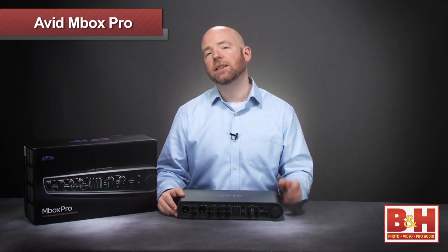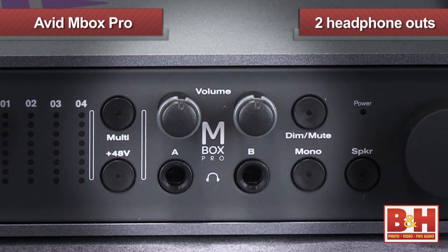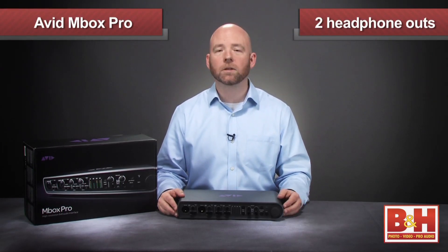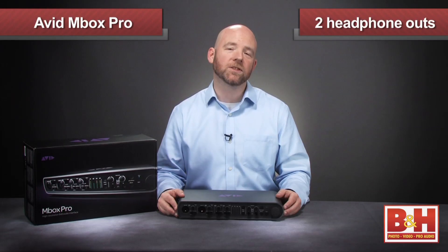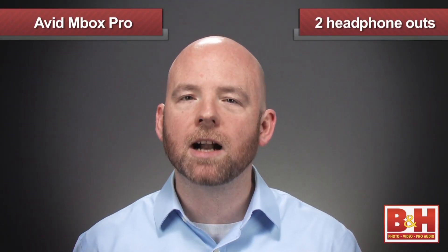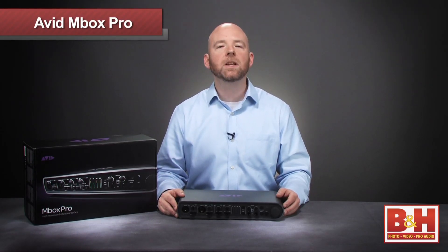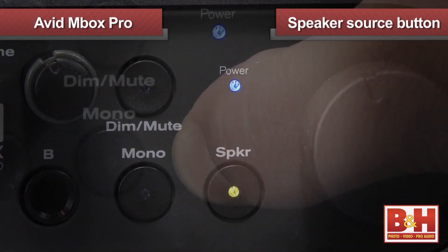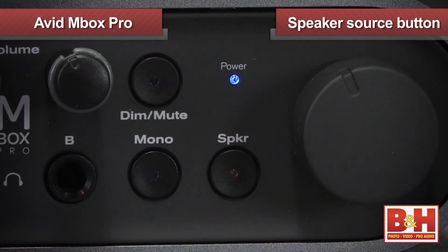With the Mbox Pro, it's easy to set up separate cue mixes for our players so they can get the blend they want. With two independent headphone outs, I can plug the singer's phones into headphone jack A and give him a lot of vocal with reverb in his monitor mix, while the guitarist is monitoring a totally different mix with less vocal and more guitar from headphone jack B. Each of them gets more of themselves in the monitors, and you get better performances from happy musicians. Having two separate headphone jacks means I don't have to sacrifice a pair of monitor outs for a second headphone mix, so I can still have three different sets of speakers to choose from for monitoring. The speaker source button toggles between speakers and lights up a different color depending on which set is selected; hold it down and it sources AUX inputs 5 and 6 so you can easily monitor an external source — a handy way to quickly compare your mix to a reference mix from a CD or MP3 player. The button even blinks to let you know you're monitoring the AUX inputs.